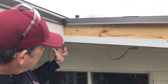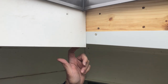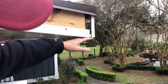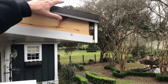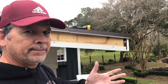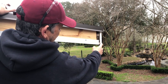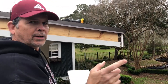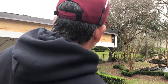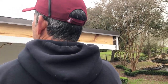This is our reveal — how far below our flashing the fascia hangs. On this side you'll see that it's basically level, it's even. That's because this corner of the roof sags down as it'll do, but we wanted this to be straight and it is. We did the same trick with the laser on this one. We'd rather have a straight fascia board that you can see from the outside than an equal reveal on the backside that you're not going to see.